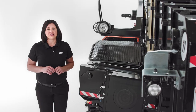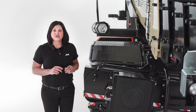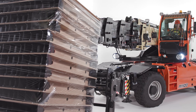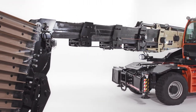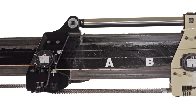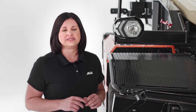When it comes to reaching and lifting, the R1370 and the R1385 have four-section booms, while the R11100 has a five-section boom. They are all cylinder and chain driven to support higher reach and greater lift capacity. Continuous auxiliary hydraulics come standard on all models and are required with attachments that need constant hydraulic flow. Optional dual auxiliary hydraulics are also available and are necessary when operating multifunction attachments.